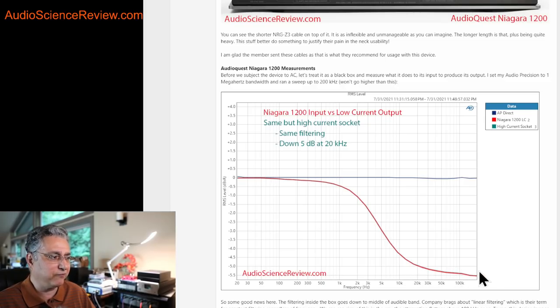The company claims it has constant filtering across all frequencies, and I can see that it's approaching an asymptote or flattening out. I don't understand why they think that's a good idea. If a little bit of filtering is good, a lot of filtering is better — so why would you want to filter less? The designer claims this is an audible thing, that you don't want to filter some of the spectrum and not others. But these are all well above the hearing range. Outside of hearing range, you want to filter 20, 30, 40 dB — not just five decibels.